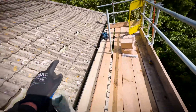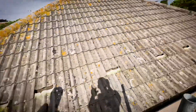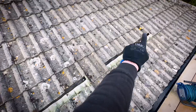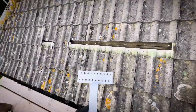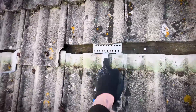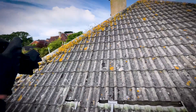We're just getting the roof hooks marked out as we go along. On the inside it's wooden slatted, so you can't actually see where the rafters are on the outside. We have to drill a hole and send Marley up and he'll give us a measurement from the first one to each roof hook after that. Once you've got the bottom ones in, we can then just mimic it on the way up. The first roof hook is in and we've put screws equally spread out so we know where all the roof hooks are going to go - because we can't actually see the joists. We've got to notch out the back end of the tile so that they sit nice and flat. That's our first rail's roof hooks - we'll mimic that to go up again, and then we'll have the two rails along there. We've got one landscape panel there and the scaffold has nearly finished on that side - 11 panels done on that side.